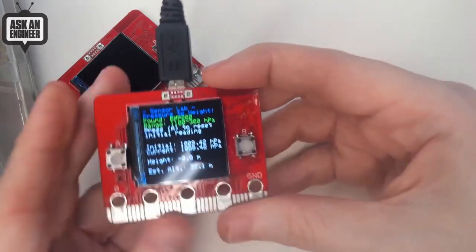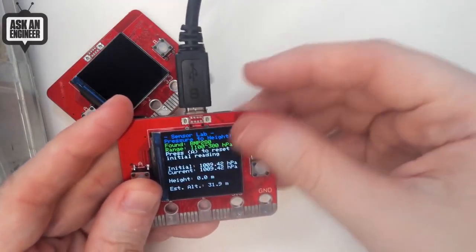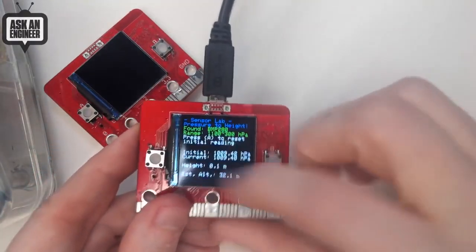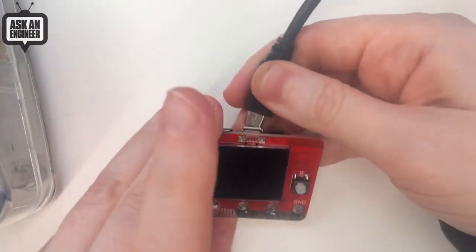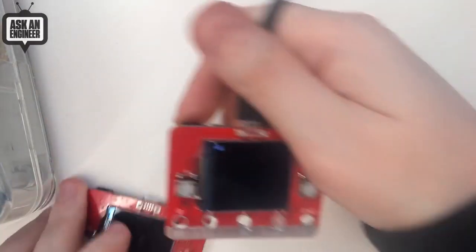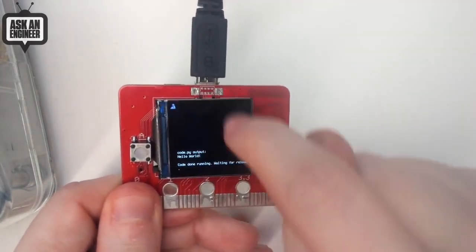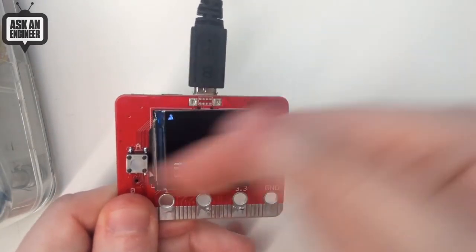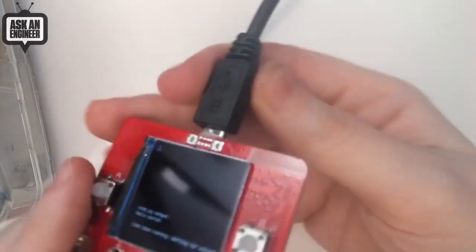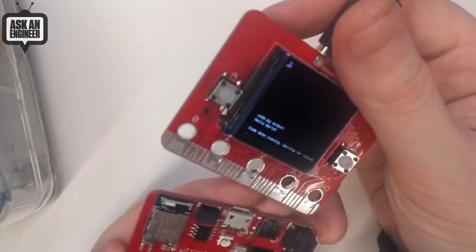It doesn't work with MakeCode yet — MakeCode doesn't have NRF52840 support. We'll probably add it later in the year, but we don't know when and I don't want to commit to a date. For now, this is Arduino — I'm running Arduino code here. We're also doing CircuitPython on this version. On the front, it has an APDS color, light, and proximity sensor — I haven't soldered it on yet. So this is CircuitPython, just a little blinker. You just have to change the refresh orientation so it goes up and down, not side to side. You can run CircuitPython, and we have drivers for all these libraries. I'm just going through and testing everything. I'm going to do another revision or two, and maybe I'll put it in the store.